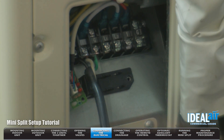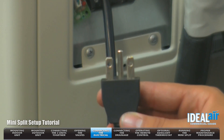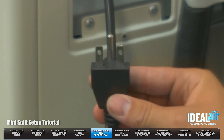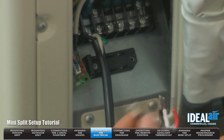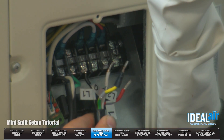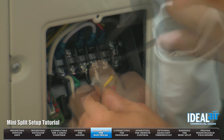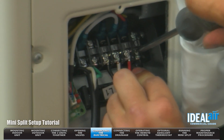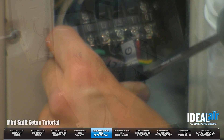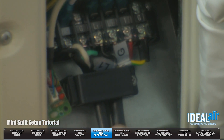So now we have the power wire. If it's a 24,000 or a 36,000 BTU, it's a 240 volt circuit. As you can see here, I have a 240 volt plug. Now we're going to connect the wires from the indoor section — we're going to connect those all to the associated positions. I'm going to put our wire retainer, and that's going to maintain those connections so that the wires don't get pulled out.